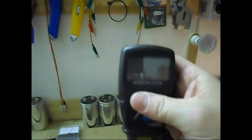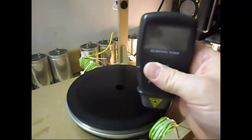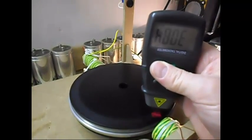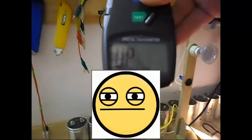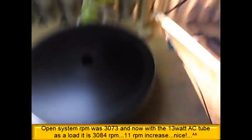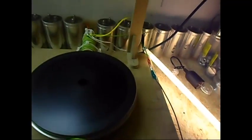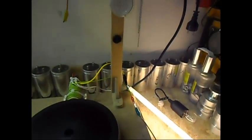With the RPM, we had 3073. Let's see what the RPM is doing now with this 13 watt fluorescent tube load. And as you can see - 3084. So we had a little bit of increase. That's why I'm running it at around 3000 RPM - because for this load I need a little bit higher frequency of the rotor, which is the RPM. Around this RPM is exactly the sweet spot. The increase in RPM or speed under load is just tiny, but it doesn't have to be a large amount - just above the sweet spot and you get this effect.